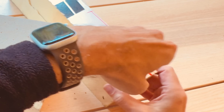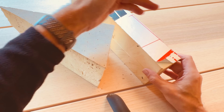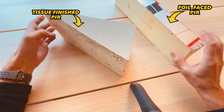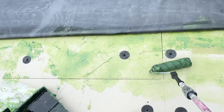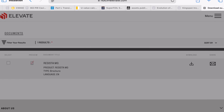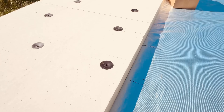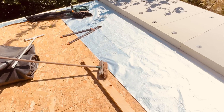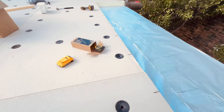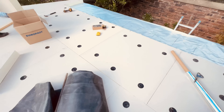If you can take one thing from this video: in these days of super-thick, high-performance insulation, you should never have any timber product on the cold side of your insulation. Eliminating timber on the cold face means adhering our EPDM rubber membrane directly onto our insulation using a solvent-based contact adhesive. Forget foil-faced insulation — we need to use a tissue-faced PIR product. The tissue facing creates a key for the adhesive to bond directly onto the insulation. Kingspan TR27 is one option, but I'm using the Resistor product — same thermal performance and easier to source. I'm using 1.2 meter square sheets at 150mm depth to reach the required U-value to pass building regulations.